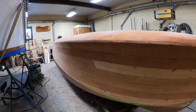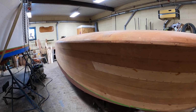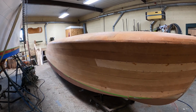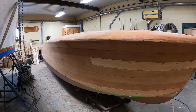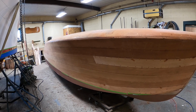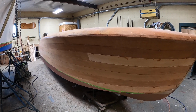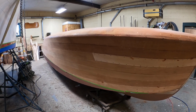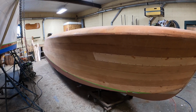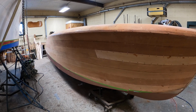And Mike Mayer at Lake Oswego Boat Company in Oregon recommended, and if you go onto our website, you'll find his very detailed article where he makes a case for not applying clear penetrating epoxy sealer above the waterline, for the simple reason that once you get that wood sealed, God forbid that you would ever post-staining sand through someplace, and oops, and you get a little blush. Well, if the wood is sealed with CPES, even Mike's Wonder stain, his gel stain, will not penetrate.